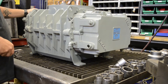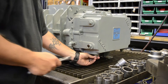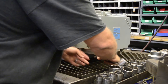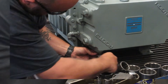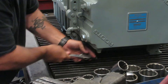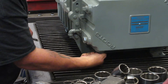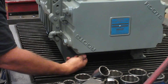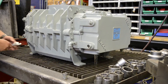The only tool you'll need for this is a crescent wrench. Find the drain plug — I like to pull the one located underneath the sight glass. Loosen the plug, then pull the plug and set it aside. Let the machine drain.